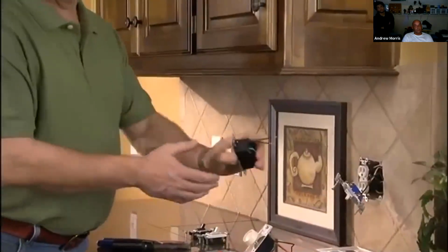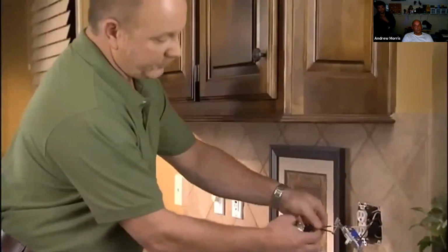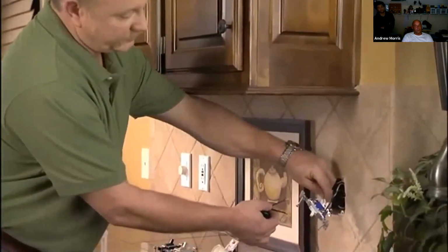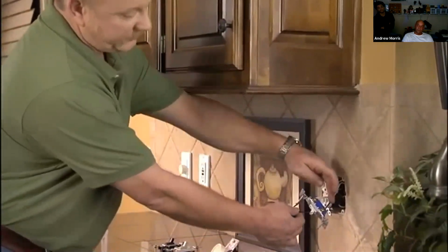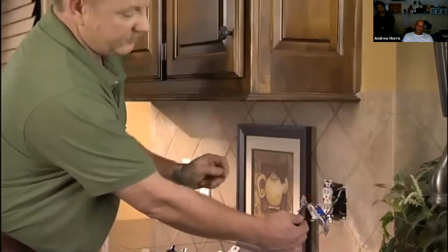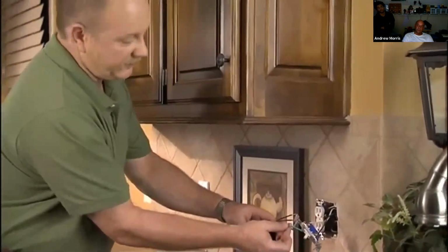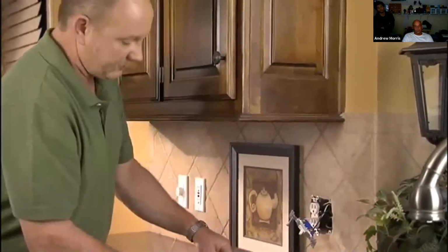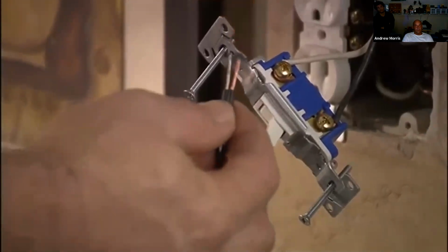So our single pole dimmer, which is the push rotary dimmer, we're going to remove these two wires from the switch. We'll take the first wire connected to one wire on your dimmer. The second wire gets connected to the second wire on your dimmer. In this case, we have a ground wire on the dimmer that gets connected inside the box to the other ground wire. Take the two wires coming in, twist them clockwise,